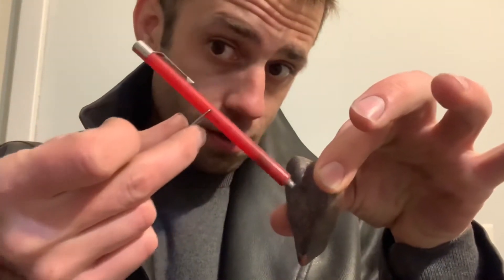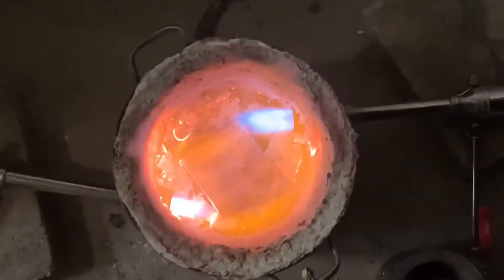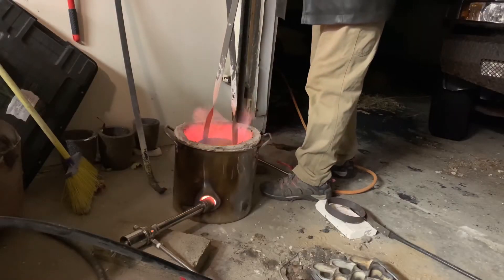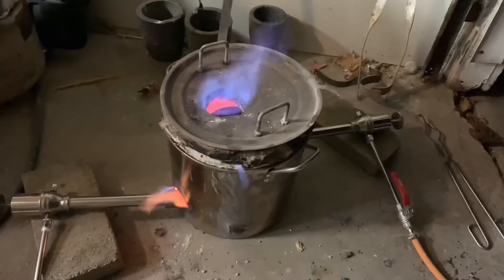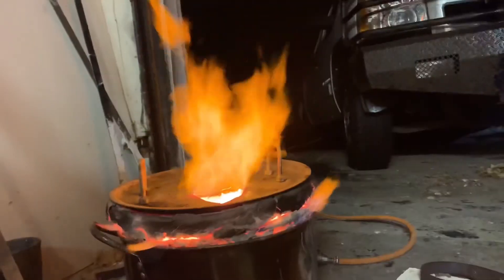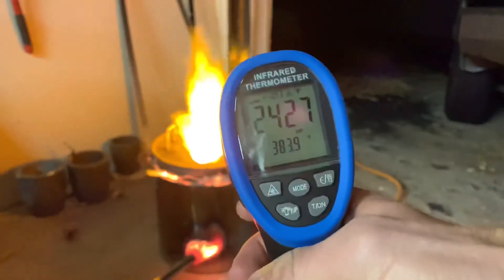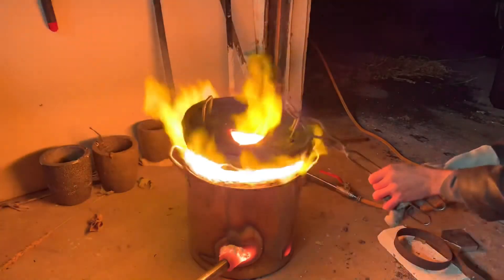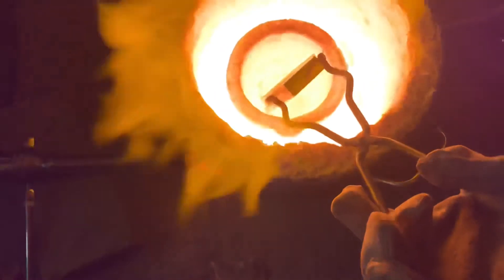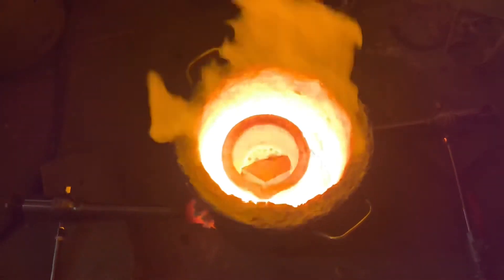There is some iron in there — the iron must have floated up to the top. Supposedly it's gonna mix if I get the temperatures right. I'm starting to wonder if the chemistry of the aluminum is essential for the metals to actually mix properly — let me know if you've done this. I'm adding the iron into the molten copper to hopefully reduce some of the oxidation, and adding the aluminum. You can see the iron is still floating on top there, and it also sucked out so much heat that it kind of solidified when I put it in place.